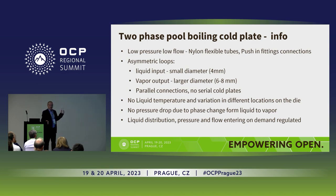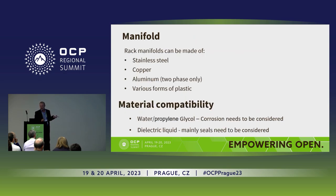All cold plates have to be in parallel — this is different from serial components where tubes go from one to another. The reason is that liquid comes in and vapor comes out; vapor cannot be reused for another phase change. So all of them are in parallel. In water, you have different temperatures in different parts of the die, but not here — and there's no pressure drop. Liquid distribution is done by the float.